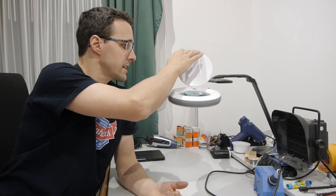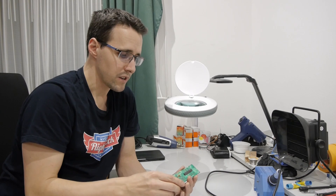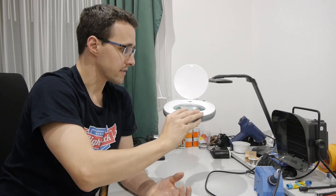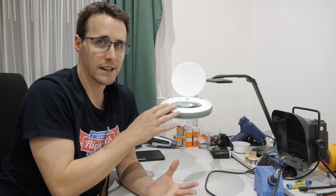This magnifier makes everything underneath it eight times bigger, and this comes in really handy when you want to check PCBs or want to look at the pin numbers of D-sub connectors. It's mounted on a movable arm so it can be away when I don't need it and quickly in place when I do. The magnifying value is a little bit too high for all-day work, so I only use it when I need it — I think 2.5 up to 5 times magnification could be better.